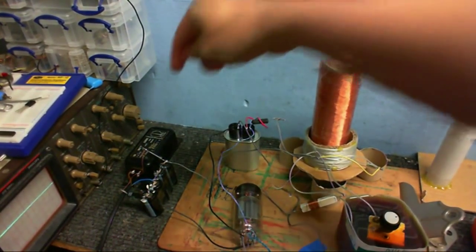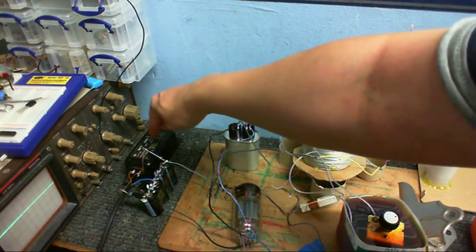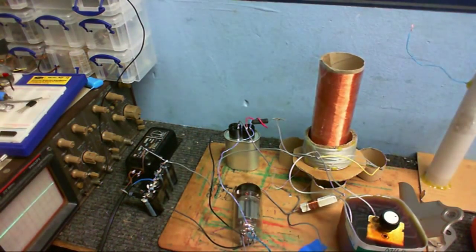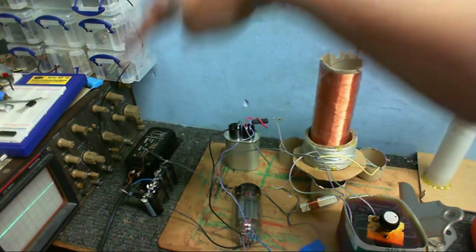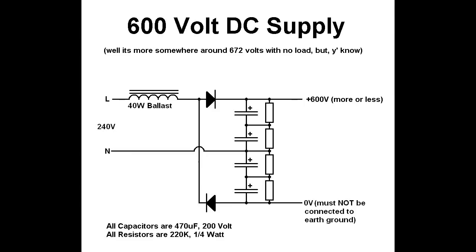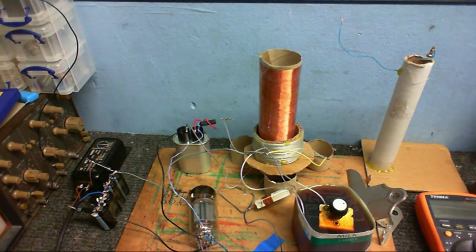Over here, this is the new and improved power supply. What we've got here is a 40-watt fluorescent ballast — magnetic ballast, of course. And that's going into my doubling rectifier, and then that's going into the circuit. The advantage of that is that I don't have to use heavy transformers to get a good 600 volts into the circuit.